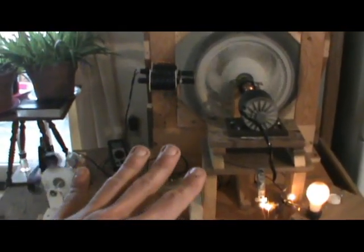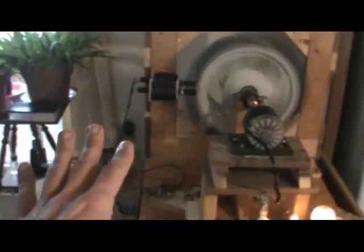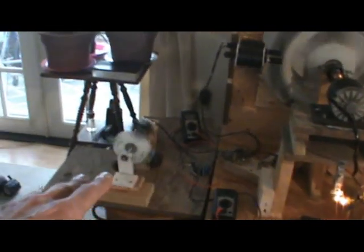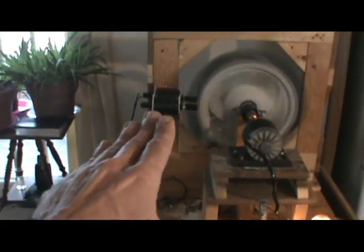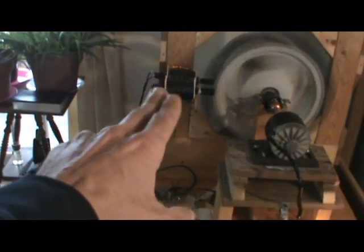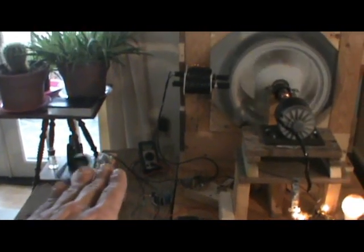Getting sorted: the core, the wire size, how to get current to go through the load. This is why I want just a slightly thicker gauge wire. I'm going to continue working with 20 gauge wire — a 20 gauge wire is going to make this wheel go faster, still give a good voltage, and go through the load well.